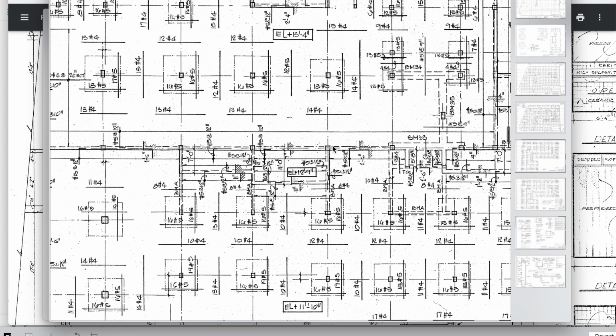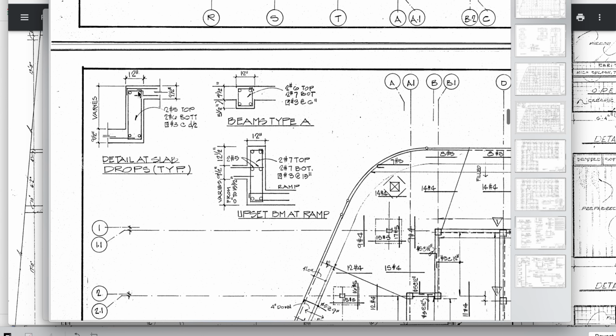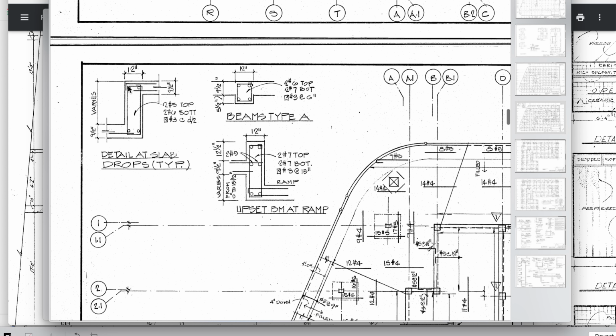I have a problem with the video because it looks like some anomalies are going on, where it looks like concrete is in front of this column here, right to about here, approximately here. That means a break would have happened here, a clean break. And it also means I probably would have lost my BMA, or my transfer slab was ripped off, depending on how they jointed this. It pulled down the transfer slab. Is it in this one? It pulled down this section here. Now, it's possible to pull down this section here, and then it flipped it over.